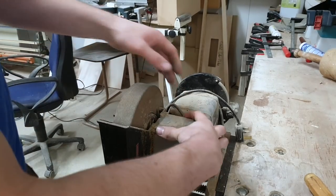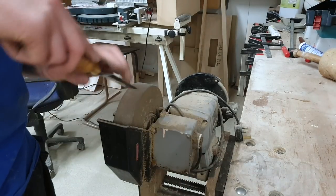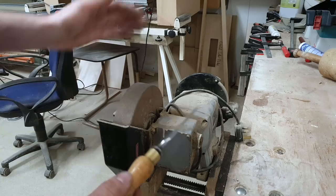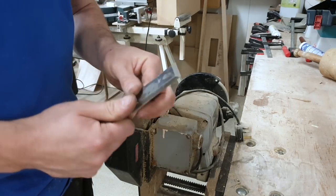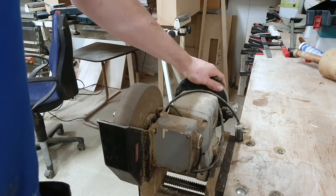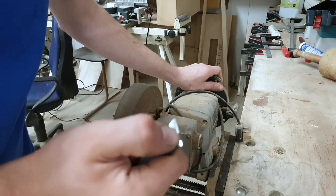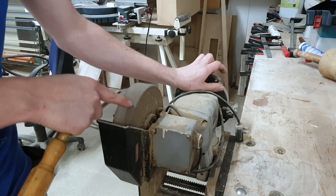I used to have a jig that clamped over the gearbox here, holding a board at the 35-degree bevel, and your chisels would hold onto the board and you'd grind them away until there was no damaged edge and the bevel was flat all the way across. I'll put in the description how much these cost — they're nowhere near the cost of a Tormek. The important thing is to avoid the high-speed dry grinding wheel, as it'll heat the edge and cause the chisel to lose its temper. Once tempered steel loses its temper, the edge chips instead of cuts. Keep it cool with a wet wheel.